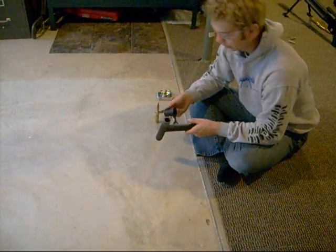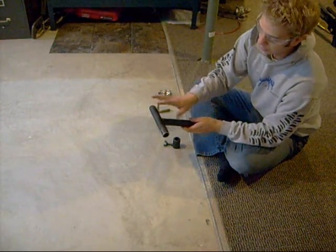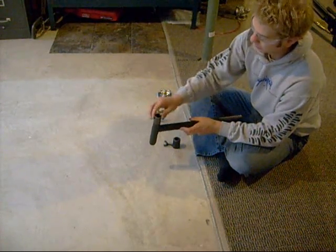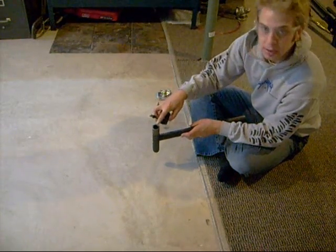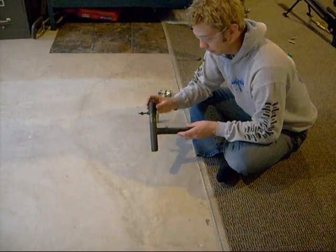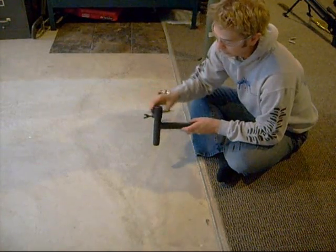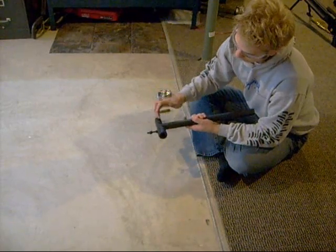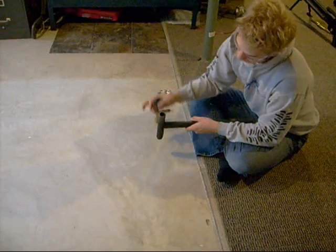I painted it for you. Basically all I did is I took some tubing — it's just hollow, about 7 inches long, welded a cap on it. This piece just has the same ID as the OD of the main tube — it slides on. This is to tighten the cap on so it won't come off when you're pulling. Then I just welded on another ring of that same tube so I have an area in here for it to sit.